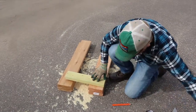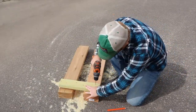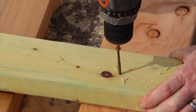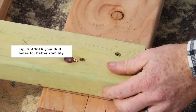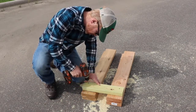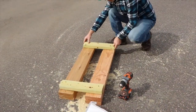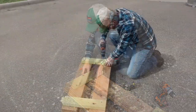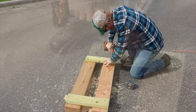Check to see that the location of the leg connector allows the dishpan to slide back and forth. While holding the leg connector firmly in place, drill two holes at one end, then attach it to the top of the first leg with your deck screws. Move over to the second leg and repeat the process to attach the other end of the top leg connector. For the bottom leg connectors, mark a location about an inch or two from the bottom of the leg to give it stability and a uniform appearance.